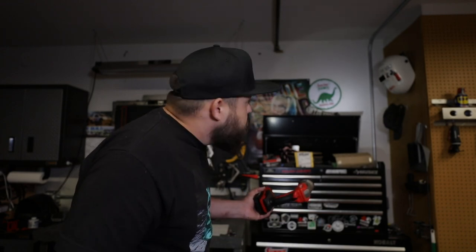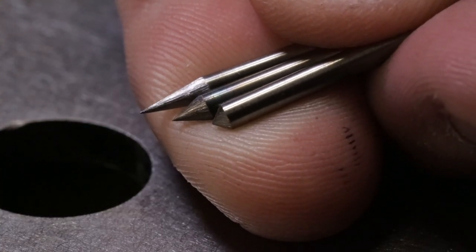When you have a very sharp point, your arc cone is going to be very large. When you have a tapered point that's more blunt and small, your arc cone is going to be more narrow and you're going to get deeper penetration. How your arc comes off of the tungsten is the most important part. With a blunt tip, the arc comes off a lot tighter than it would from a very sharp-tipped electrode. Therefore, if your arc cone is tighter, your puddle is smaller, your arc is more focused, and you're putting a lot more heat into a small area. Long sharp taper: less penetration, wider arc cone. Short stubby taper: more focused arc cone, deeper penetration.